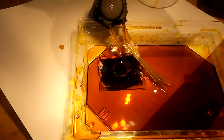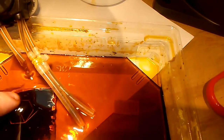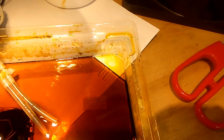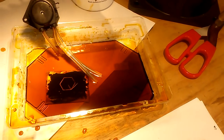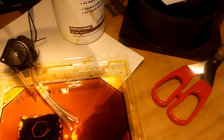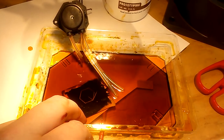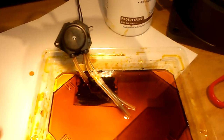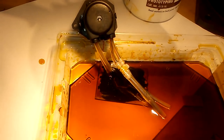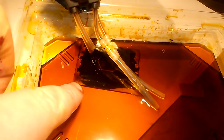So in a few minutes — it's 2:30 now — we're going to actually start our work. I'm going to count how many minutes it takes to get this thing to where it wants to be. In the meantime I'm going to put something under it to make sure it's level. The drip here has two effects: it pushes the ferric chloride down and allows some movement. The idea is simply that it will speed the reaction up a little bit. You can actually see it's starting to work.